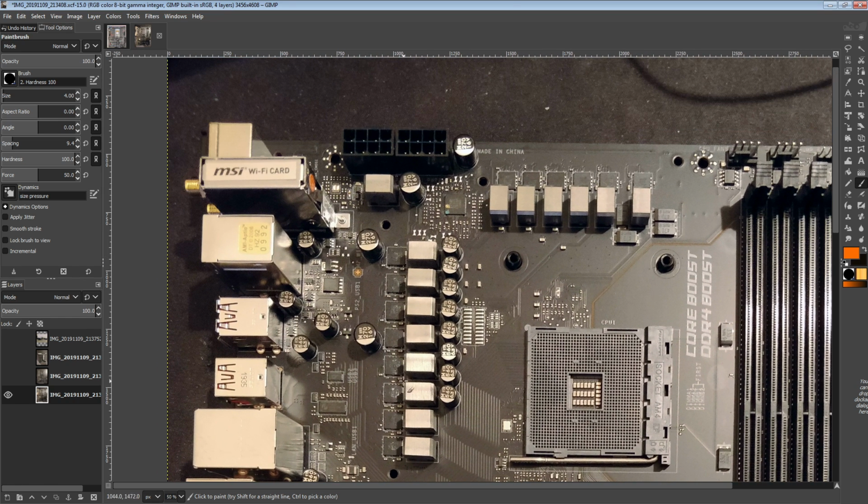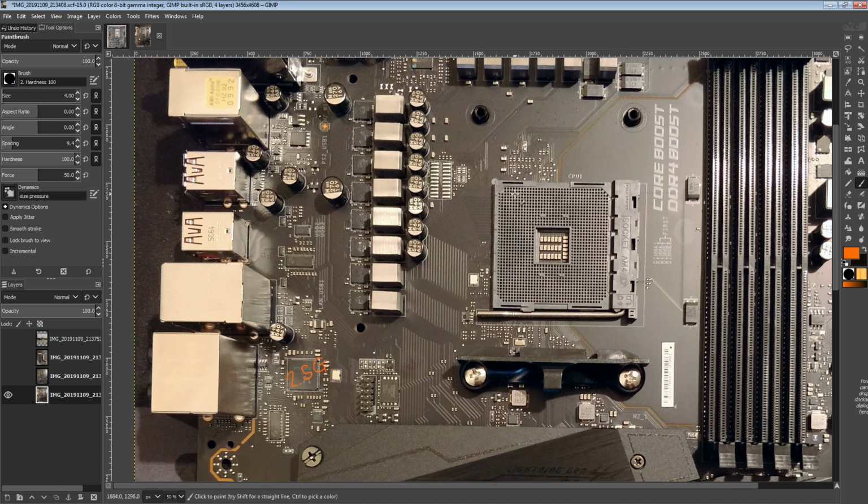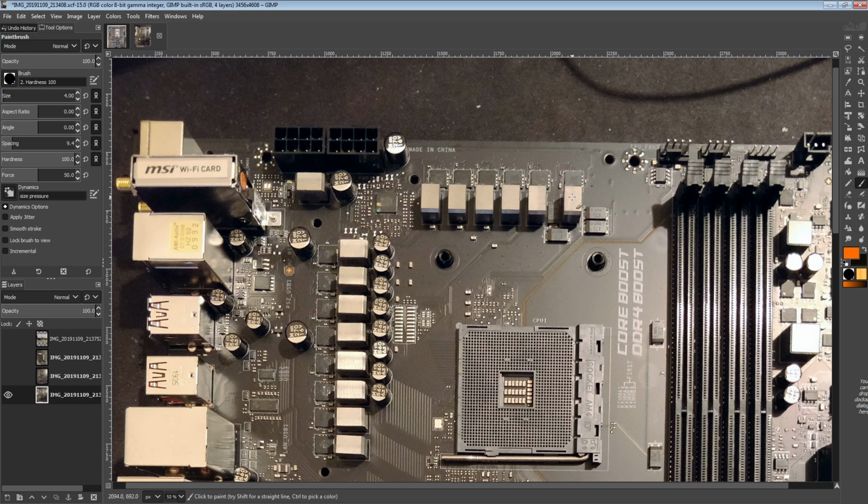Yeah, and ultimately, I also think this is only viable on lower power platforms like Z390 and X570. If you did this on something like X299, well, you'd need another 8-pin, in my opinion. And triple 8-pin is not something I've seen on a power supply. That's not a thing.